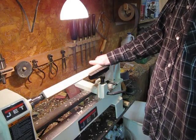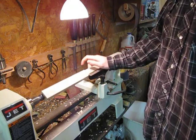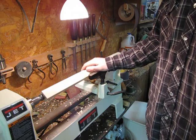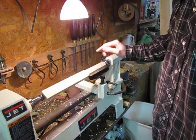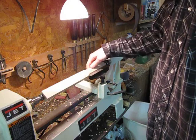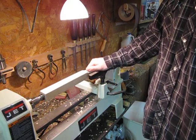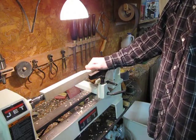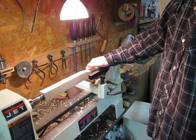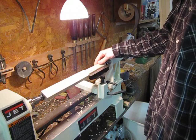Here I have the blank for my tap's dowel chucked up on my lathe. This is the reason you want to make your guide block first and have the hole drilled in your guide block — so that you can size the dowel to that hole. You want a nice fit so that it's not too sloppy, giving you an inaccurate nut, but you also don't want it too tight so that you're having to apply more force than is already necessary in tapping the nut.